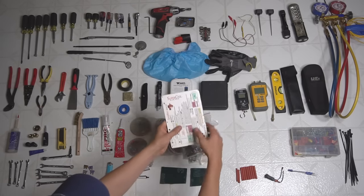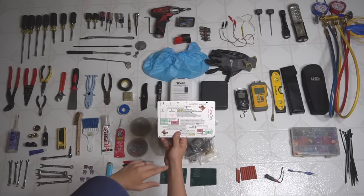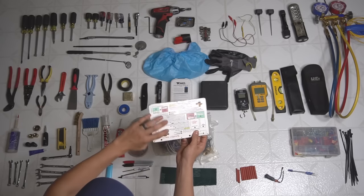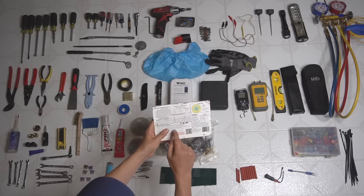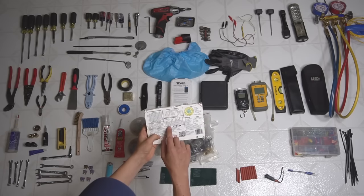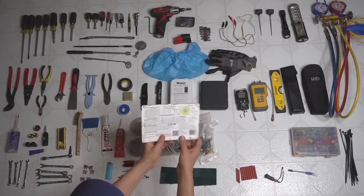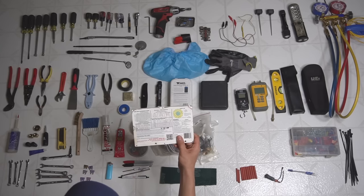This right here is a super cool slide rule, used for refrigeration or Freon — to recharge a unit that's low on Freon using superheat, showing you step by step how to do that. Or if you have a TXV metering device you'd use subcooling. I primarily use it for the system operating diagnostic chart, which has all the common Freon issues and what the different pressures and readings will be for every single issue. They even have a mobile app now. If you're a service tech and don't have this slide rule, I definitely recommend getting one.